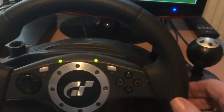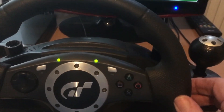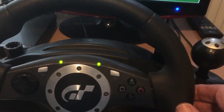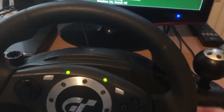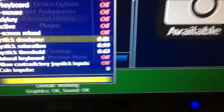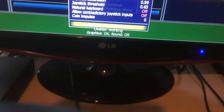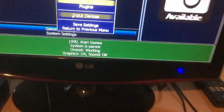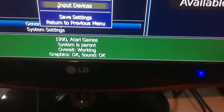What that does is take away the slack, so you've got just a little tiny bit of movement. Otherwise, the way it's preset, you've got about this much slack before anything happens. Set it to 0.1, then press Escape, and make sure you press Save Settings — double-click on Save Settings.